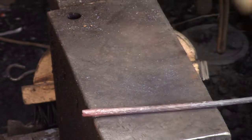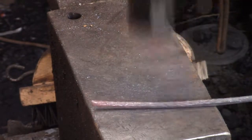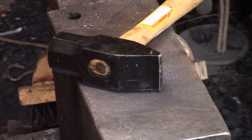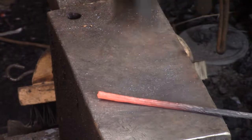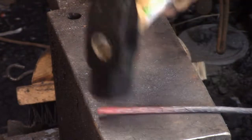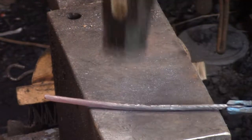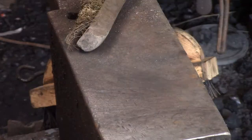I've been repurposing the small ball peens — I have a punch, a butcher, and a hot cut. We'll see how long the edge lasts on the hot cut. So far it's held up — it's a pretty fat angle, so it wouldn't be good for cutting anything too thick, but so far it works out okay.